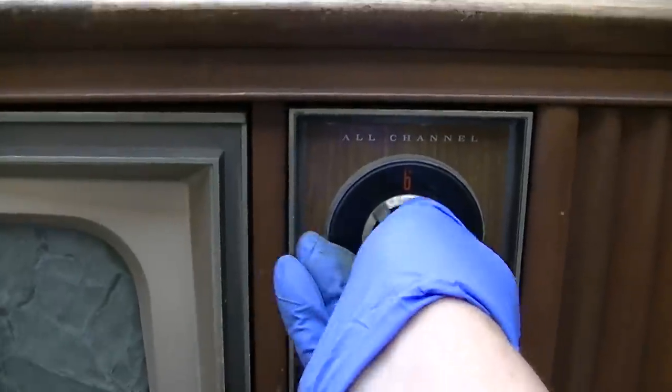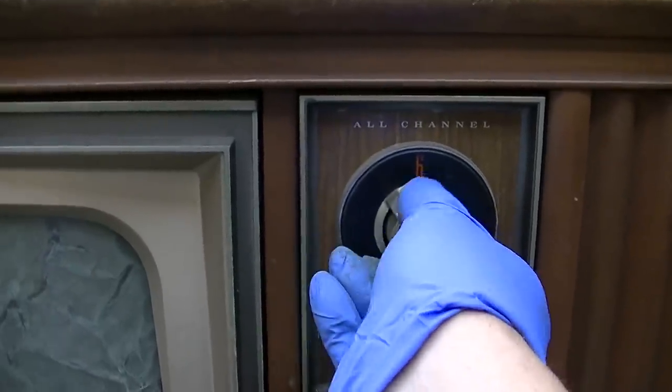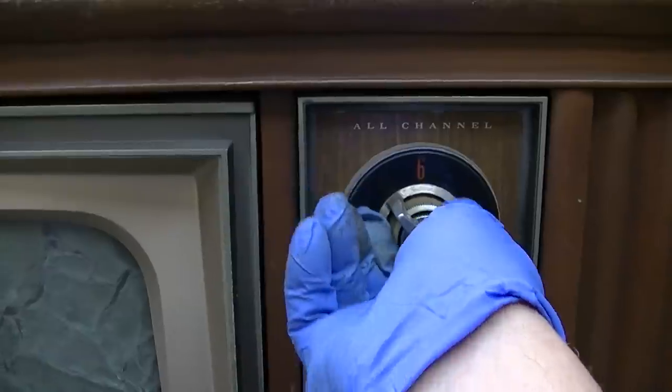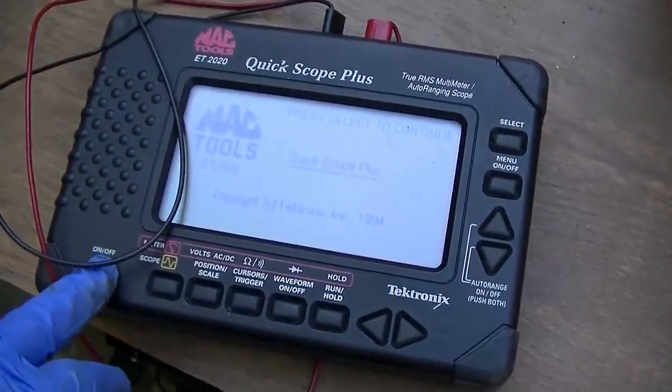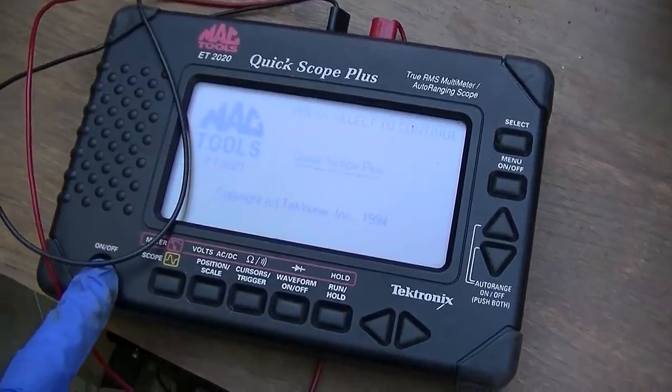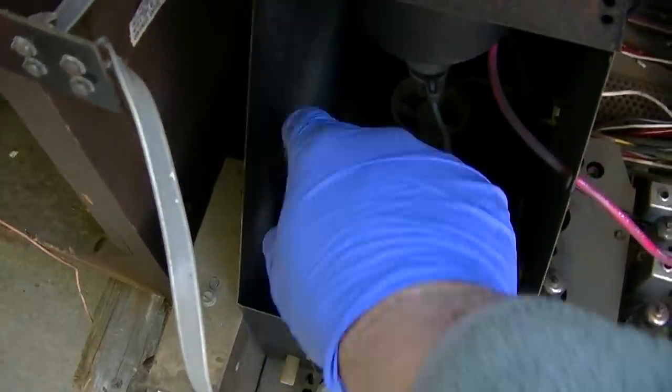I don't know what that high-pitched squeal is. I've never heard that on a TV before. It looks very blurry, like there's no focus voltage. It looks like garbage. Very blurry. Wait, I think I found the squeal. Okay, I moved this tube around. This is the focus rectifier.